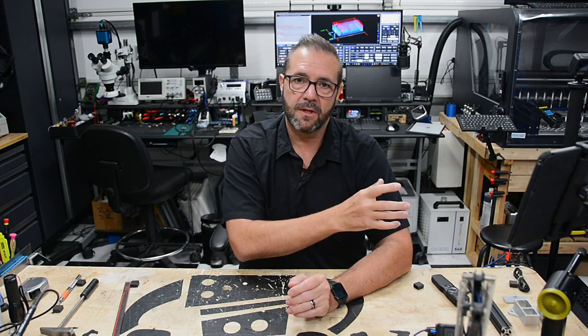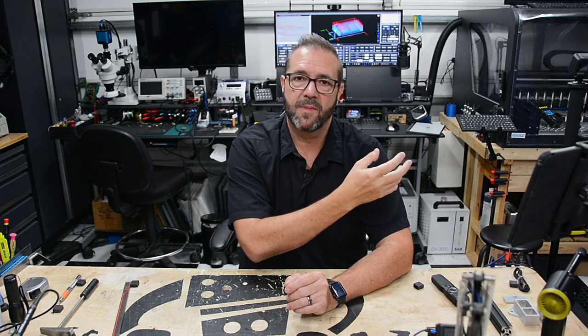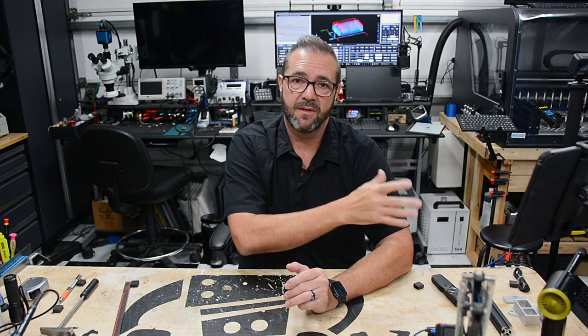So once the controller was upgraded, the junction box was implemented, the probing signal mergers, and the ATC spindle was installed, there was some basic programming required on the VFD to be compatible with the spindle. I also used the relay again to work with the water cooling and light pole that I had installed previously, to give some visual feedback if the pump's not on before we turn on the spindle and things like that. Now, all of the functionality for the ATC would be handled by the M6 script.